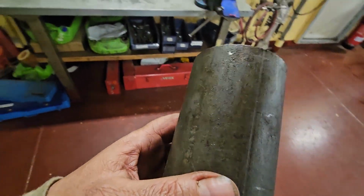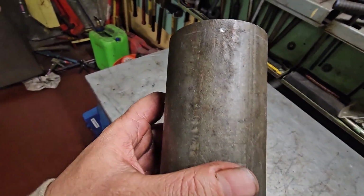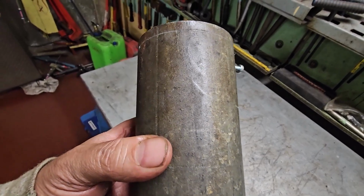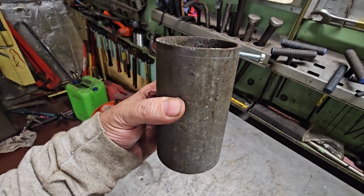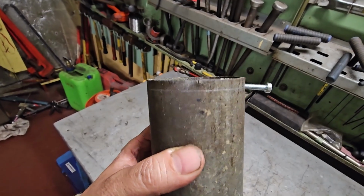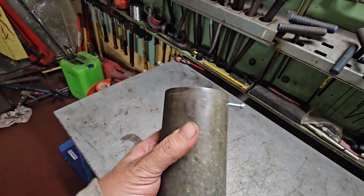Okay, so tonight what I'm working on, we have our main engine fuel injectors, but there's no cover for the tips, so you have to be extremely careful. But so what I'm doing is making, this is going to be a cover. It's going to go over the bottom, and right where I'm drilling these is a little groove where it will fit into. These will act like little set screws to hold it in place.